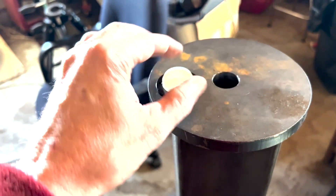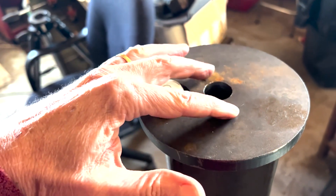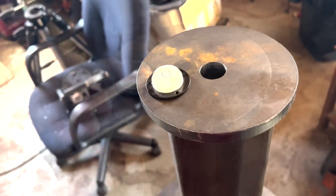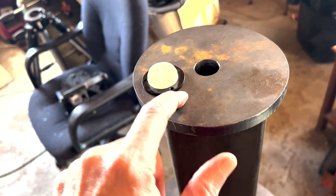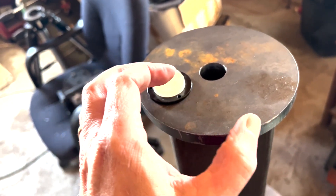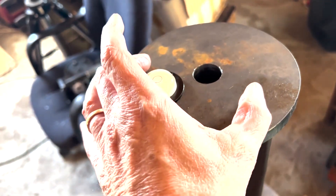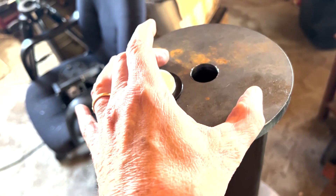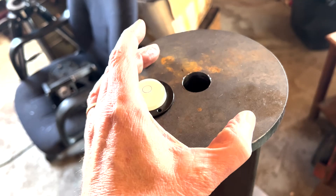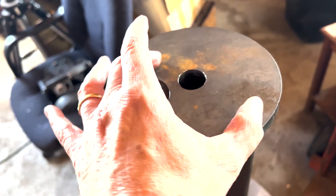These plates right here — this one is drilled for the big telescope. The other two mounts: one has about a 1/2-inch hole in the center, and the other has a 2-inch hole. There'll also be a pin drilled here to give the traversing mechanism something to push against. Once we have everything assembled, I'm going to see how well the telescope turns on this plate. We may be able to put some graphite powder on it, or alternatively I have a couple of old CDs that I can use as rotational bearings.